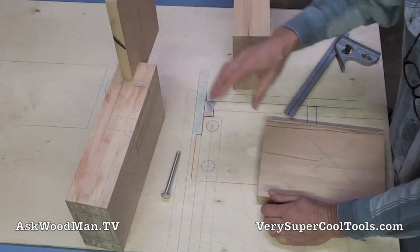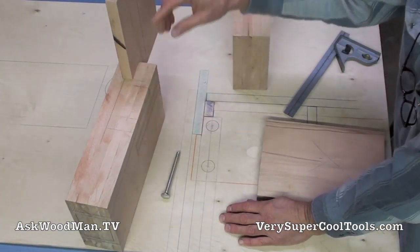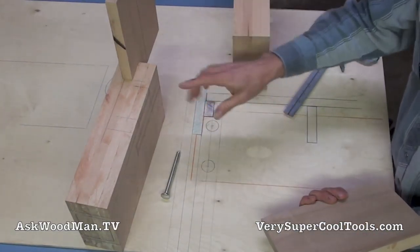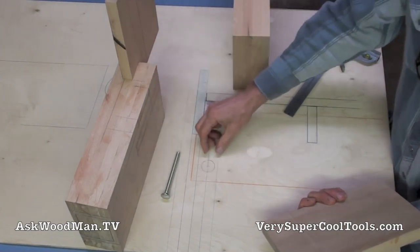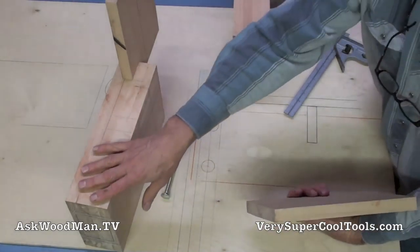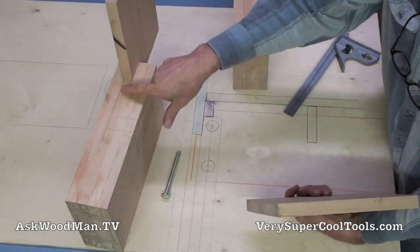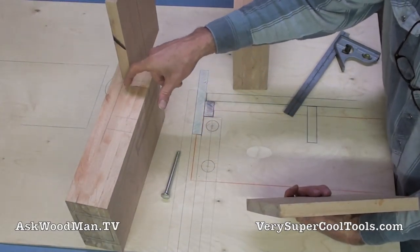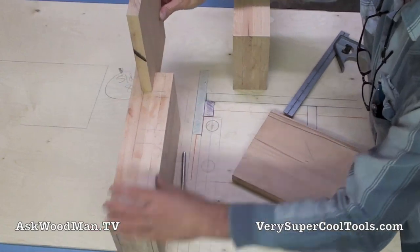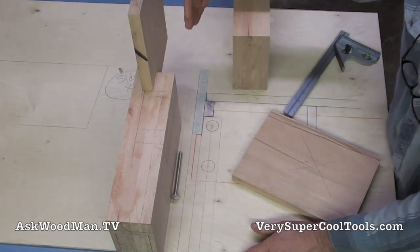When I drew this I was hoping to come up with material this thick for these legs, but I had some issues so I had to join and plane the two outside boards. They ended up being just a little narrower — it doesn't really affect anything — but I wanted them real flat for the glue-up, so I had to join and plane them a little bit thinner than this dimension here, which sets everything. Since this side rail was run through the planer at the same setting, you can see I've got a perfect fit in here.